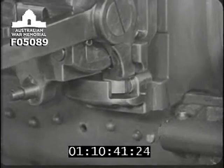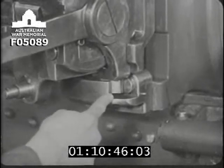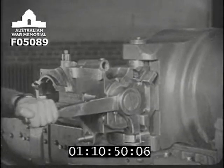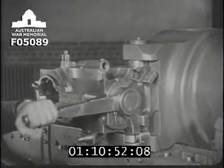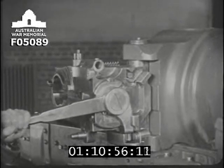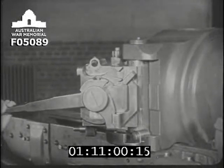The plunger forces the extension on the LBM out behind this shoulder, and so pushes the LBM up slightly. The breech cannot be closed again until the LBM is pressed down, forcing the plunger in, and so freeing the toe of the LBM from the shoulder and allowing it to ride back again round the control arc.